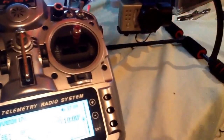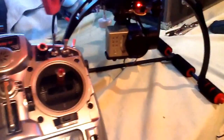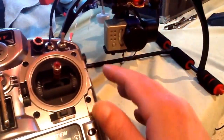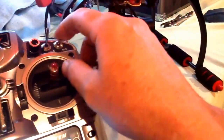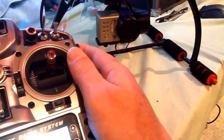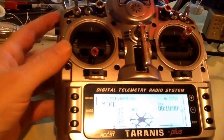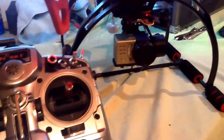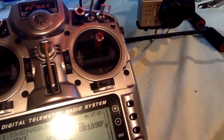For the left and right you do exactly the same thing — just make it go left and right instead of up and down. Remember, you can set this up to a slider, a switch, a pot knob, or all three. If I had it on a switch, all the way back would go up, center would go to center, all the way down would go straight down. I like it on the slider because it's right under my thumb and finger and I can control it nice and slow. You could put your three-axis gimbal on the other slider for left and right. That's how easy this is — whatever you think up, this Taranis radio can pretty much do it. Have a good one, guys.